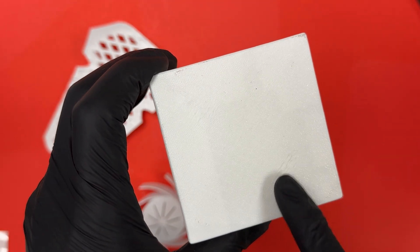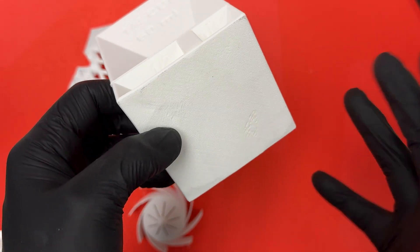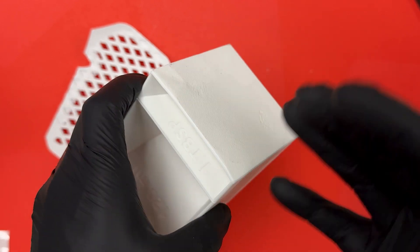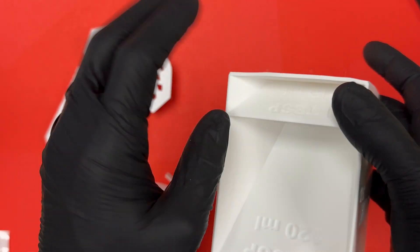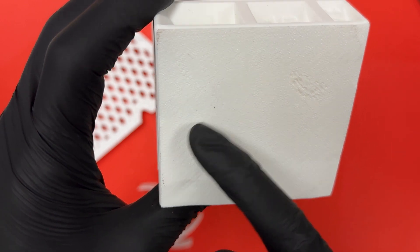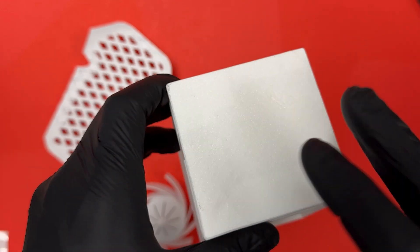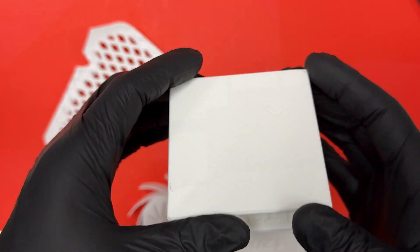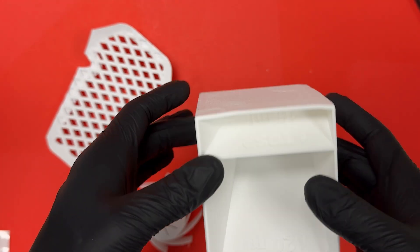White highlights small imperfections that generally aren't always caught, but are enhanced and magnified by using white. Whereas if you use something like yellow, green, red, or black, those basically become invisible — warps, of course, not. But those specks and things to watch out for with white are not always bed contamination; they can sometimes just be accumulation of dark marks from the nozzle, and it's possible that could get missed during QC checks. So white is just a difficult material because it increases your risk of the part looking a little bit off.